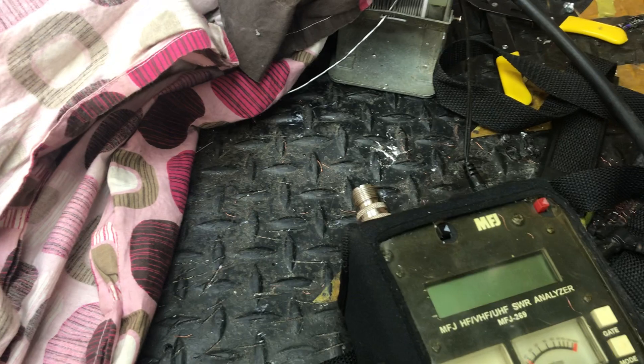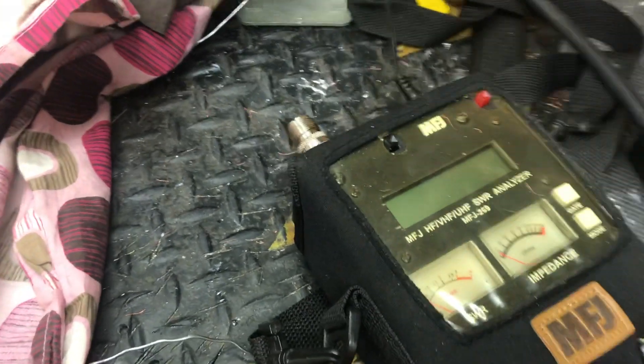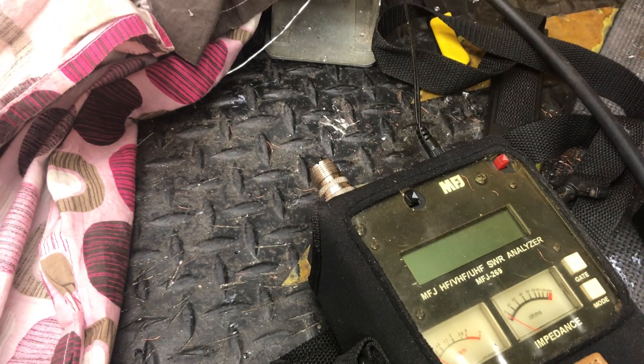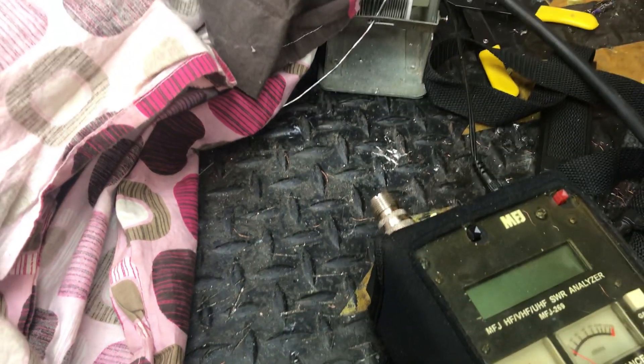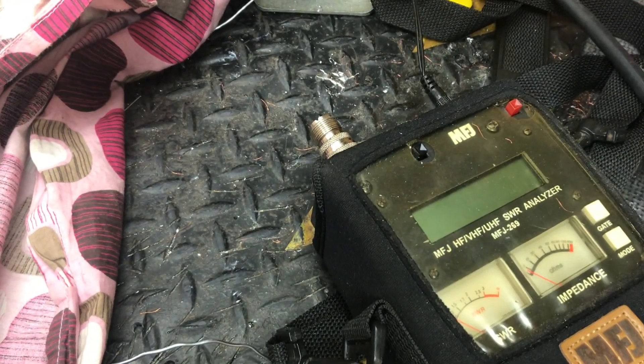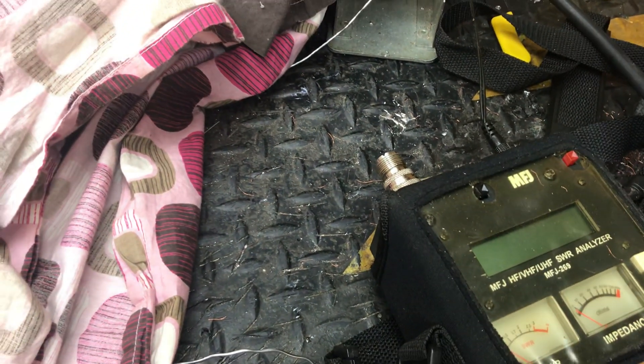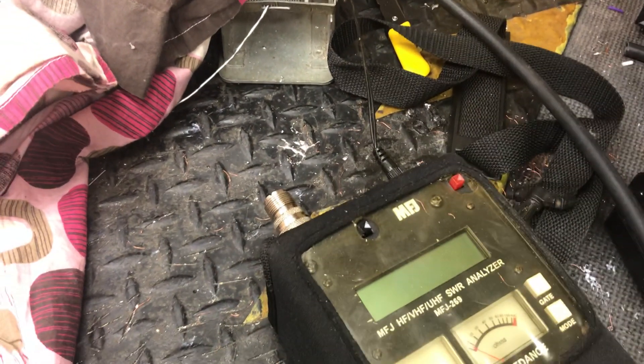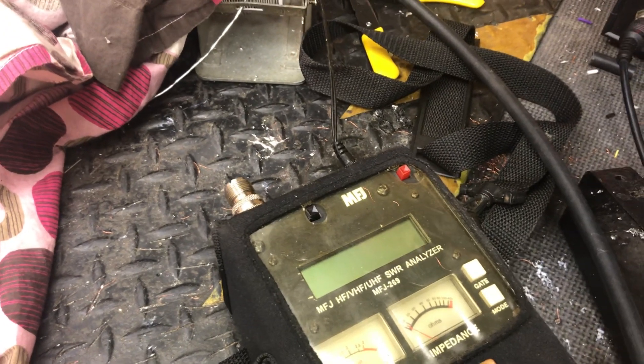I've got several Teflon ends, one of the good ones. I'm going to screw this up here where it goes. Now, the length depends on the velocity of the coax — how long you want your jumpers or your coax. Every one's going to be just a little different. So if you need 120 foot of coax, cut off 135 and do what I'm fixing to show you. If you need a 6-foot jumper, cut off 7. If you need bigger than a 7-foot jumper, cut off about 15 or 16.